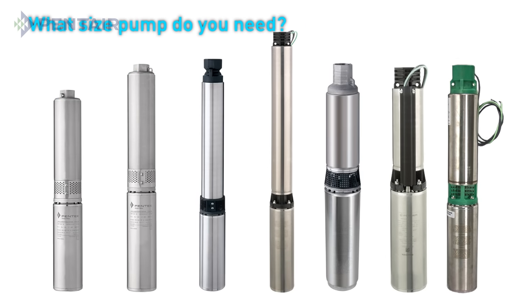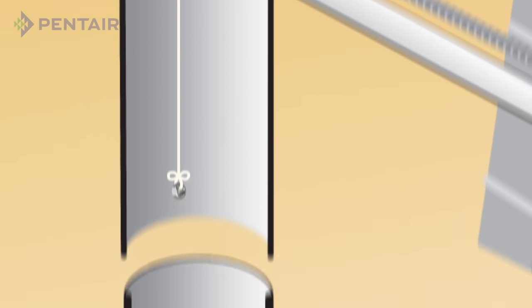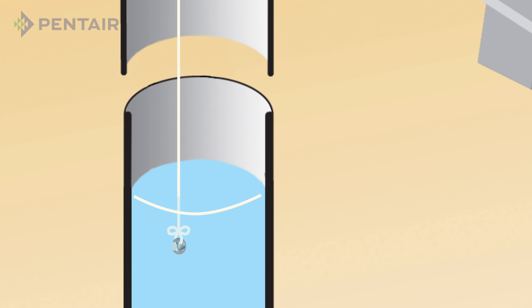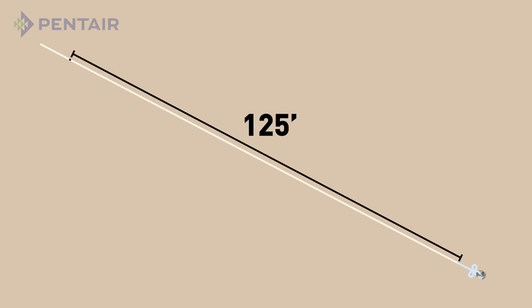Now that you know what your current pump type is, you'll need to determine what size your new pump needs to be. If you haven't already removed your pump from the well, now's the time. The first step to determine the size of the pump you need is to find out how far down your well is to water, because your water table may have changed from where the original pump was located. To check the current depth, simply tie a nut or washer to the end of a string and drop it down the well until you hear a splash. If your well is very deep, you may want to add a fishing bobber after the nut or washer, because you may not hear the nut hit water. Once you find water, lay the string across the top of the well casing, mark it with a marker, pull the string out, and measure from the mark you made to where the string gets wet.